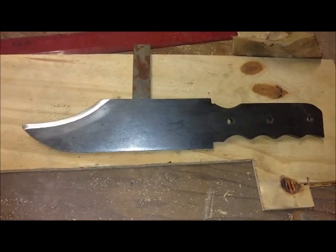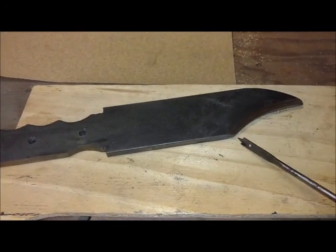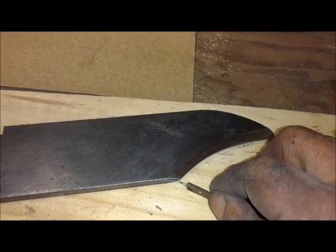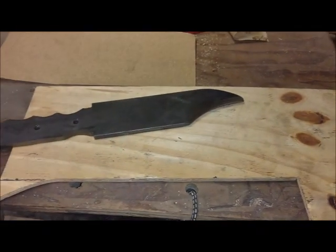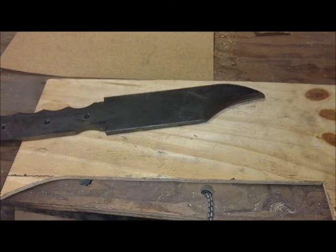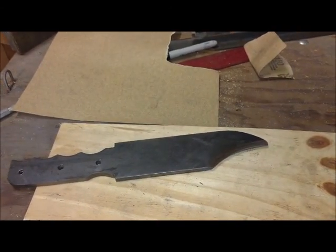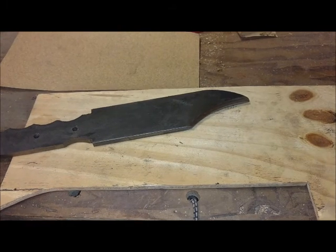Not to mention I hit this edge right here — just the edge — with some flat black spray paint. It's quarter inch thick steel, so I took a quarter inch drill bit, the point of it being in the center, and scribed a line in the paint. I've heard of using a Sharpie marker to do it but I didn't have any luck with that. The paint worked real good, and I'll do the same on the other edge when I start doing the hollow grind so that your sharp edge stays in the center of the thickness of the steel.